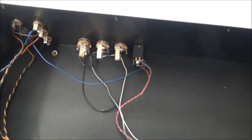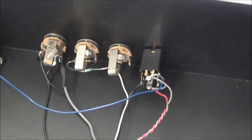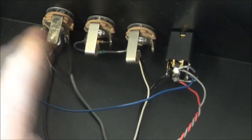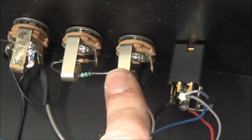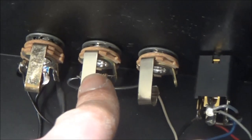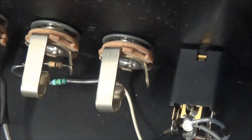with an older style key. And one of the other issues that I had mentioned was that the high and the low jacks seem to be reversed. So this is the pedal jack, this is the low output, this is the high output, and this is the external audio input, and they come up this connector here. So it looks like someone replaced these quarter inch jacks at some point. And you can see here the wire coming from the circuit board of the synthesizer is going into this one, which is the low, and then there's a resistor, which is basically a voltage divider, dropping the level down, making the high actually the low. And I don't know, that low seemed very low, so I don't know if this value of resistor is correct.